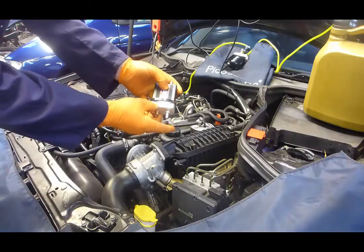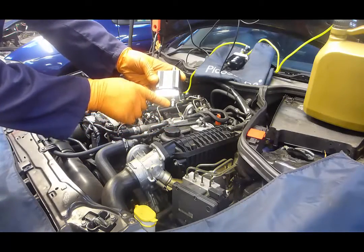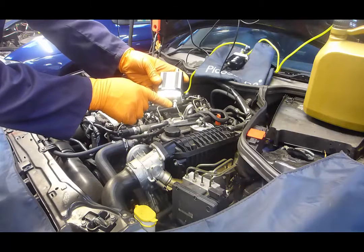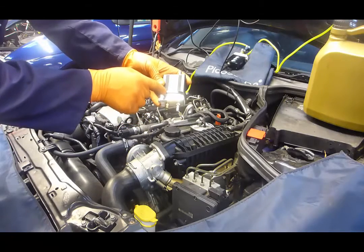Whenever we switch on the WPS, it's important to have the sensing tap — the pressure tap — open to atmosphere, because at this point we're running through a calibration. We're setting the zero to atmospheric pressure in every scale.